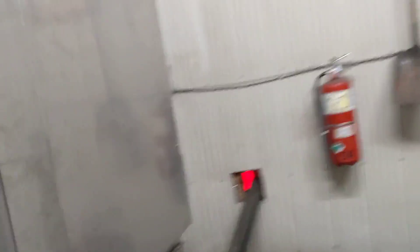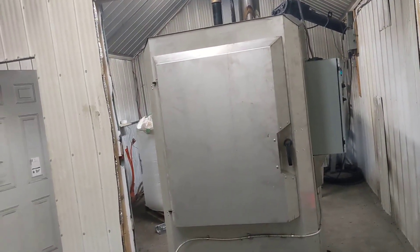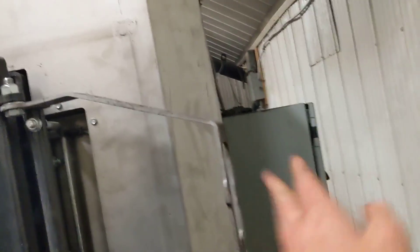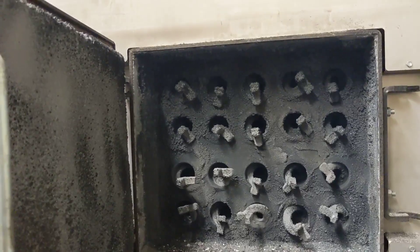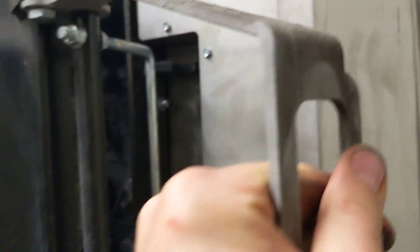This is the back — or front — of the boiler. It's a good-looking unit; mine's a little bit dirty, just a work in progress. Up top here is the heat exchanger. You can pull out any of those tubes really easily at any time and clean it out. I do that about once a month or so. It makes a bit of a mess on the ground, but I just sweep it away. It's pretty simple.